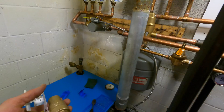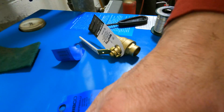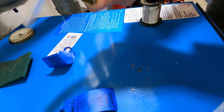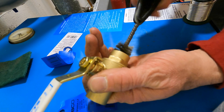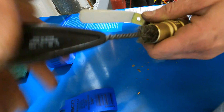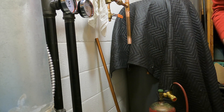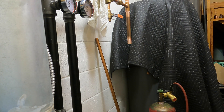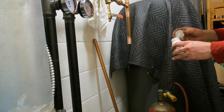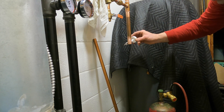Installing a lead-free valve is a little different than a standard ball valve — you're just not going to cook away at this valve. First thing, get rid of your tag. They usually have a lighter handle, like blue or white. Then clean out your fitting like you usually would, get it nice and clean on both sides. You can use sandpaper or emery cloth. I also need to cut this pipe so it will drop down to the floor from here.